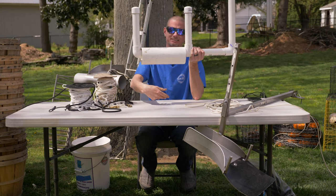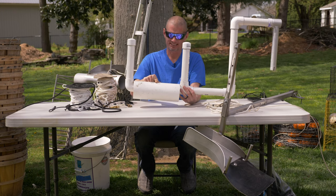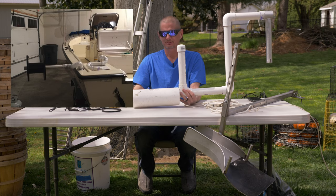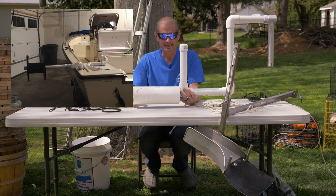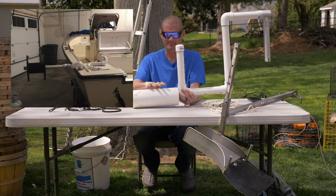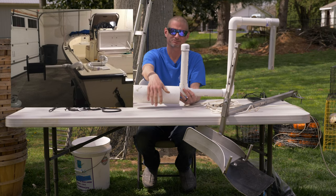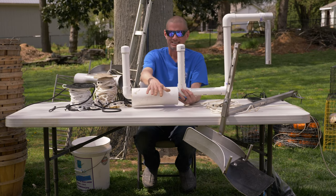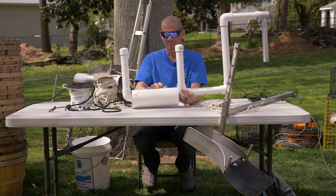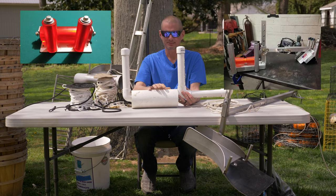You'll see pictures after a hard day's crabbing where the whole side of the boat is covered in mud. So the prop stick is a way to minimize vibrations and eliminate some of the sling. There's a flap design that really helps stop the flinging of mud. Another design I've used is like a roller — I found some plastic spools from cat4 or cat6 wire and inserted the spool between the PVC so it would actually roll, again trying to minimize vibrations and bouncing.